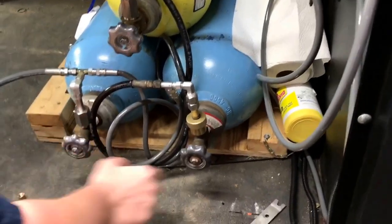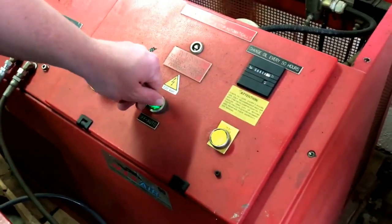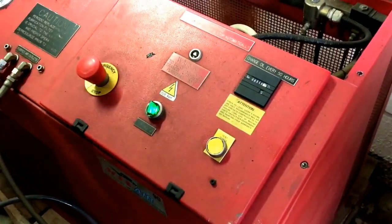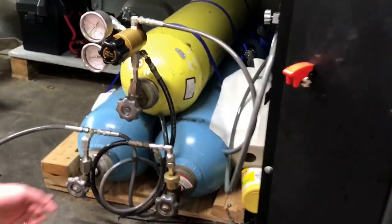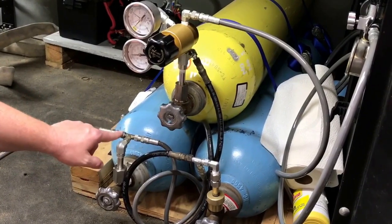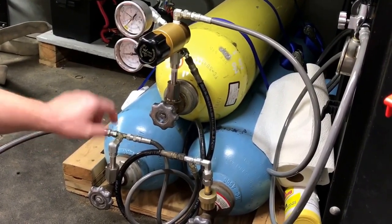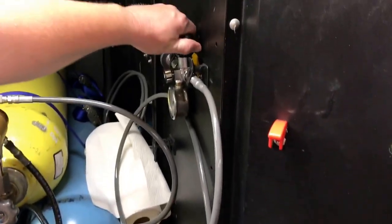All those are off. Now I have to go over to the compressor and turn the compressor off. The compressor is now off. Now I have to go back to the van. If you remember from the other video, I have to bleed the pressure off these lines — I cannot take this supply fill hose off right now because everything is still under pressure. So what I have to do is open the fill valve and it'll bleed down.